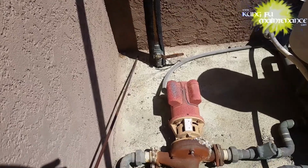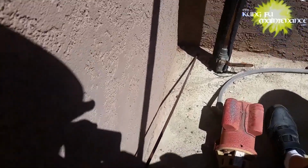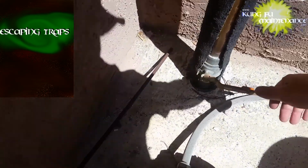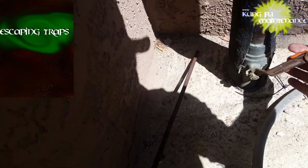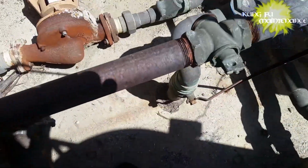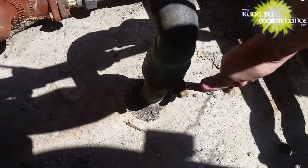Then when you turn off the hot ball valve, it's not so much pressure on the ball valve itself. And then in reverse, now I'm turning the hot water back on. So you want to turn the hot one on first while it's not under pressure from the cold side. So we can open this one first, and then we can open the cold feed. It's kind of my best tip for keeping your ball valves alive.